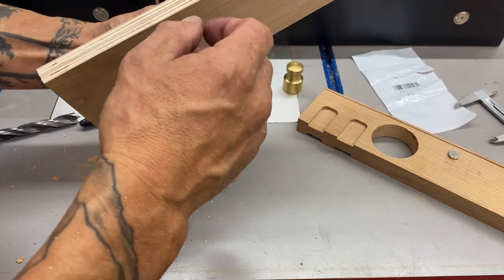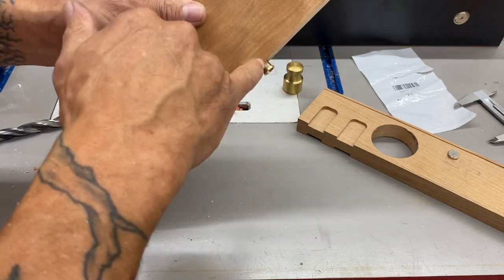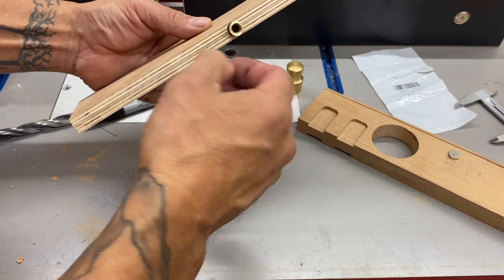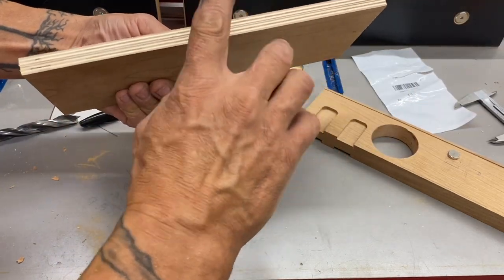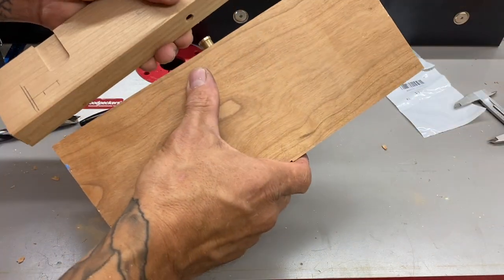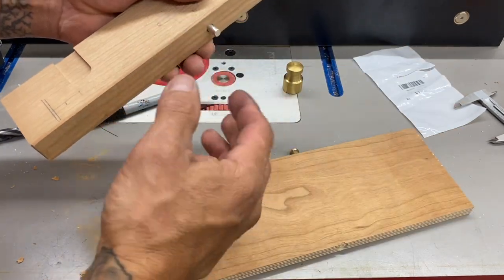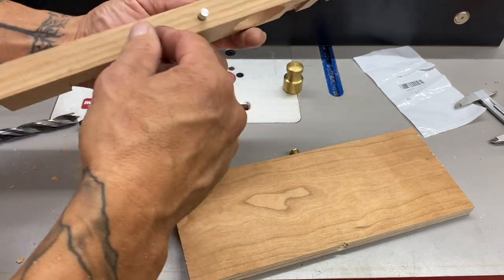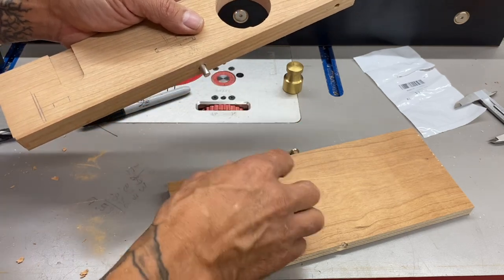As I was laying up the door I made a sample to match the door thickness. There's a pretty tight fit — I really don't want to put that in there, but I know it's going to work. This little flange will sit flush, slightly recessed, and then I'll sand till those edges are perfectly flush to each other, and that should create a nice pocket for the deadbolt. I can chamfer this edge so it'll engage easier.